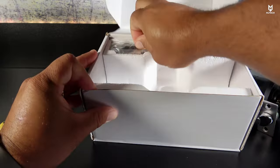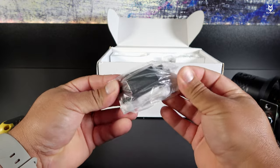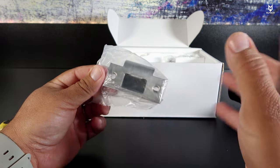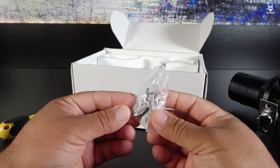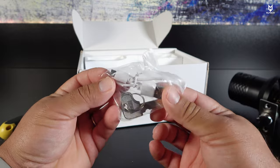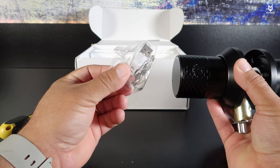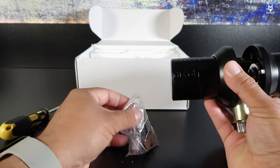Inside there's a little mounting plate for the bolt. If your door already has one, it will most likely still fit. It also comes with inner plastic, though in my case I won't need it. We also get some basic screws for installation, the keys, and a USB cable. The USB cable is for when you run out of battery — you can plug it into a battery bank or a five-volt charger to power the lock.